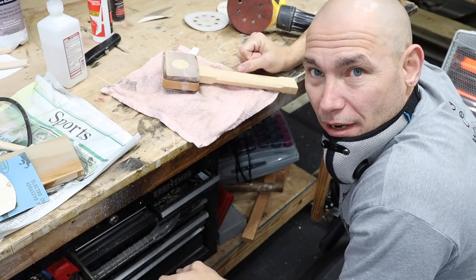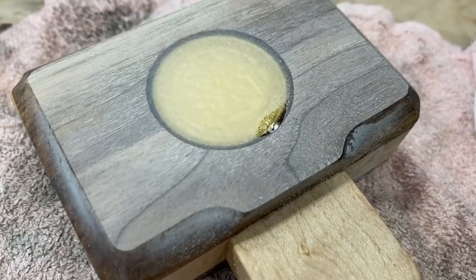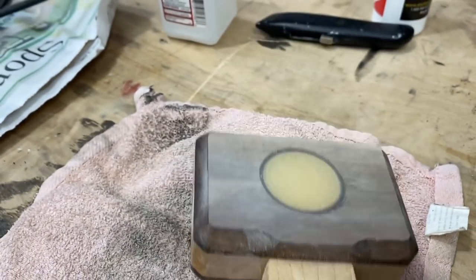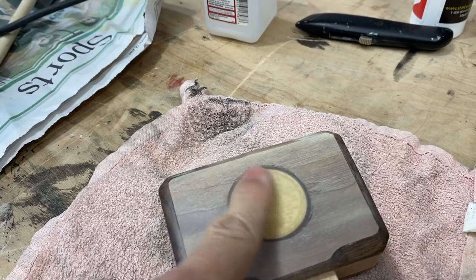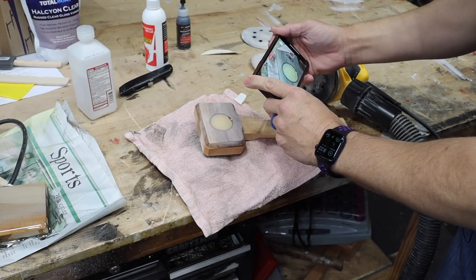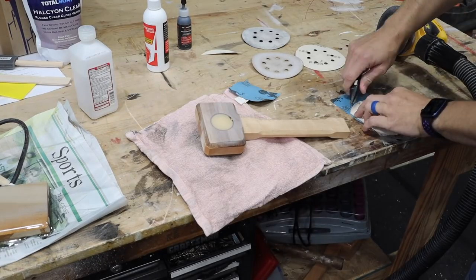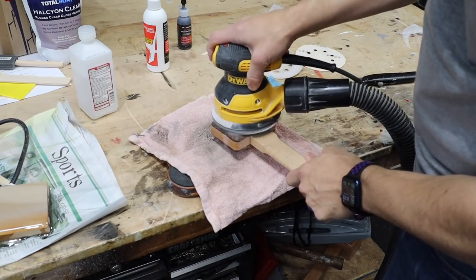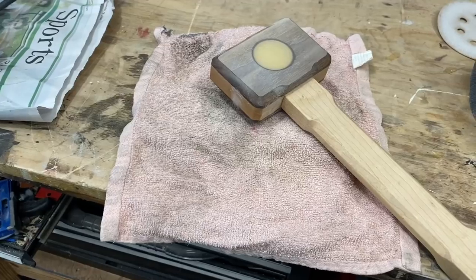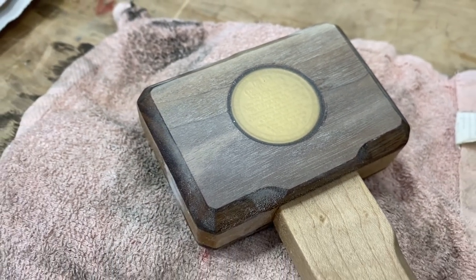It sanded smooth and a lot easier than I thought. You can see that little bit of imperfection there — that's where it's dipped in, I didn't get enough epoxy in there. So it's really better to overfill than it is to underfill. But you can see that it's still foggy, and that's after doing 60 grit, 120, and then 220. And now I'm going to try my homemade piece of 3000 grit. It's still just a tiny bit foggy, and I think that's because I skipped quite a bit of grit.